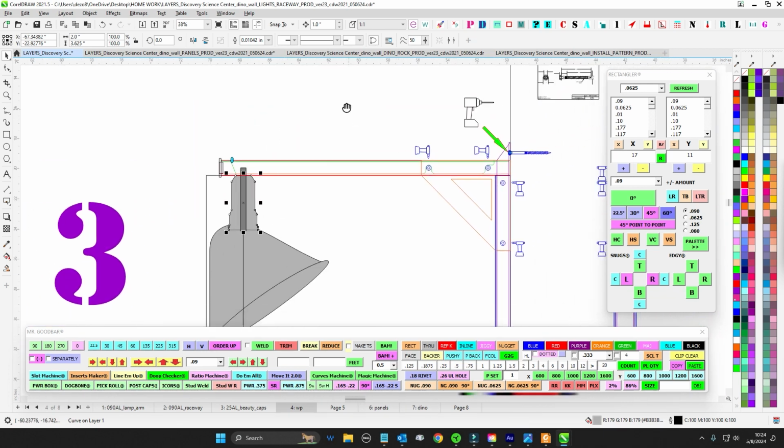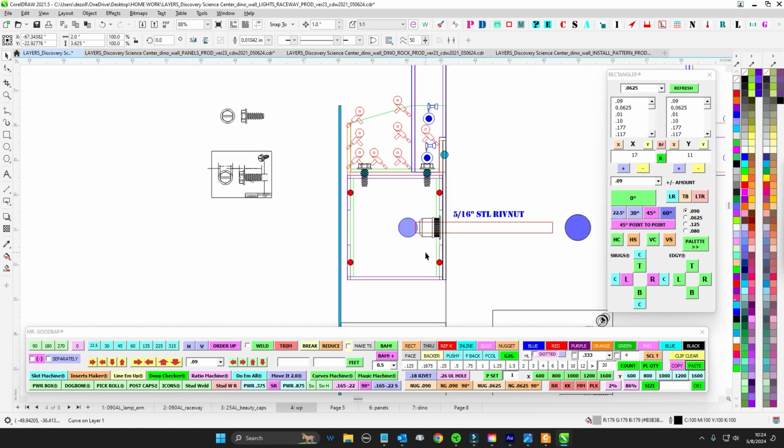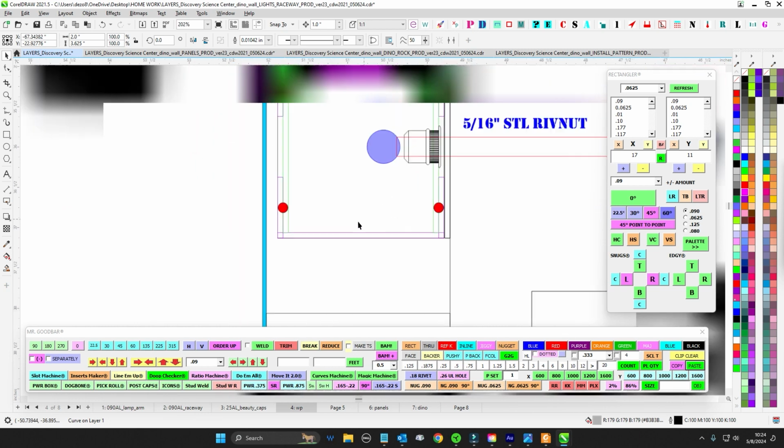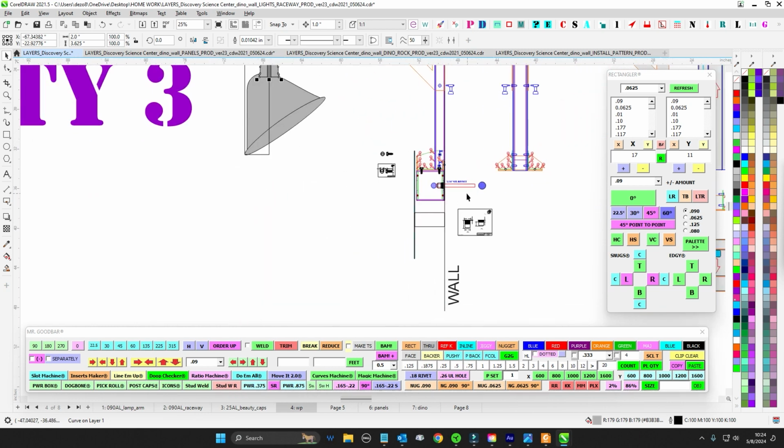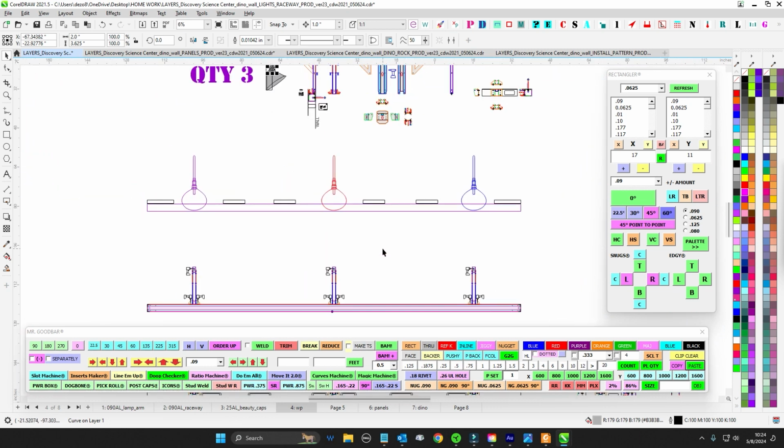And then you'll have your wires. And like I said, you're probably not going to be able to reach the black and whites down here. Also, as far as grounding, I didn't put anything for grounding, but if you guys want to, go ahead and add a grounding screw through one of these access ports.